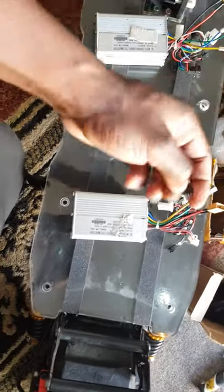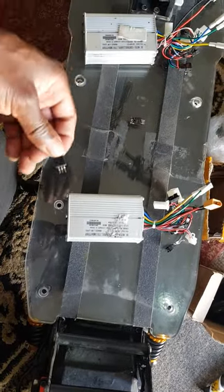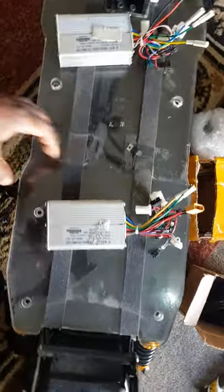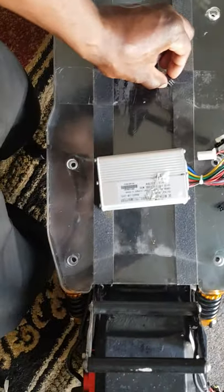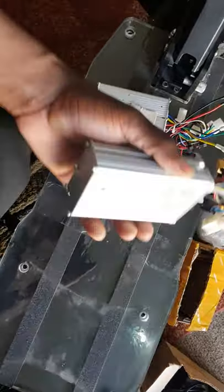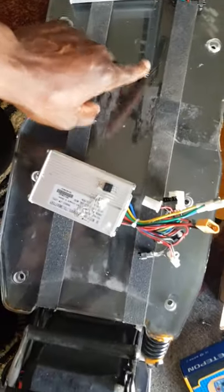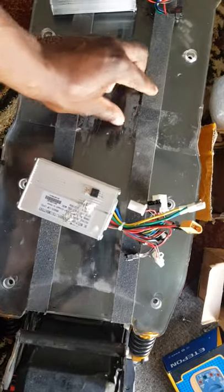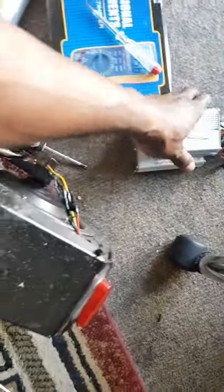When you have this, the way to replace it — I've made videos following the same procedures to do the actual job. Some of them I made a video doing it but some I don't want to repeat since people don't have too much time watching videos. All these controllers are now working — I replaced the MOSFET and it was only one MOSFET broken on each of them. I used my multimeter to test both the old and new MOSFET to confirm the new one I'm putting in is good.